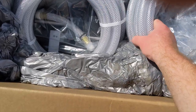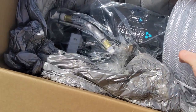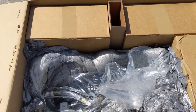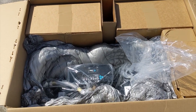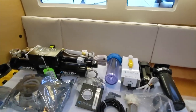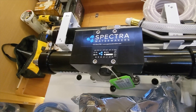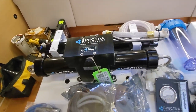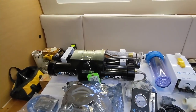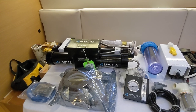We've got lots of tubing here. Everything's nicely packed in foam - probably pretty hard to damage. I'll take you through some pieces and parts here. Start with the main event: the Spectra 150R water maker at 12 volts DC. This sucker will draw only nine amps because that Clark pump recovers some of the energy that went into creating the 800 PSI. It will put out about six to eight gallons per hour even in cold water.